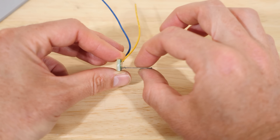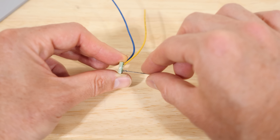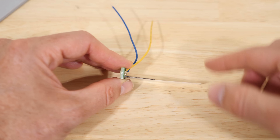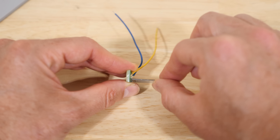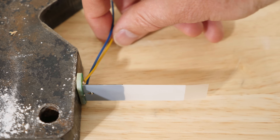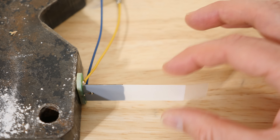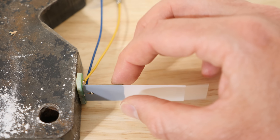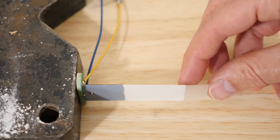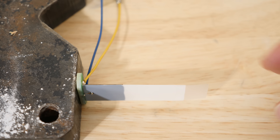And that's exactly what I have here. This piece is a piezoelectric so that when I apply a voltage, it's going to bend one way. But then if I reverse the polarity, it's going to bend the other way. And on the end here, I just have some plastic attached to it. So if we apply an alternating current back and forth, it should be able to bend this back and forth really fast and flap that plastic. I have these two wires connected to the regular outlet in my house — alternating current, 120 volts at 60 hertz. In order to get this vibrating at maximum amplitude, I have to match the resonant frequency of this vibrating plastic to 60 hertz. So I've just added tape to it until I got the maximum amplitude of the vibration. Now let's turn on our piezoelectric fan and see how much air movement we get.